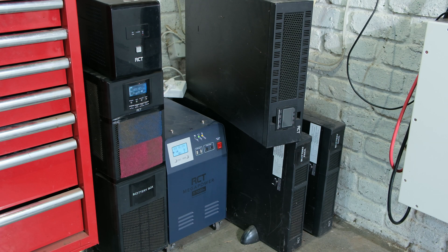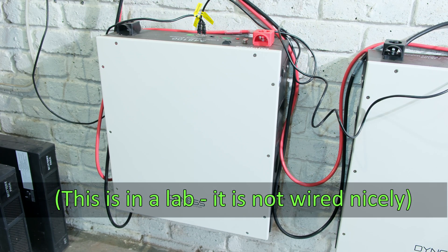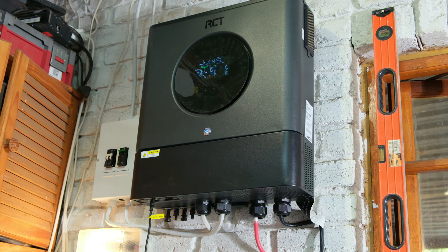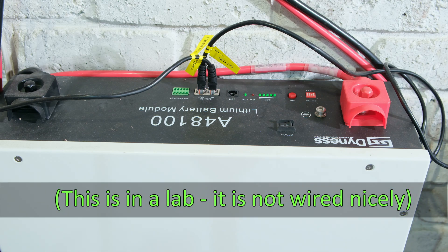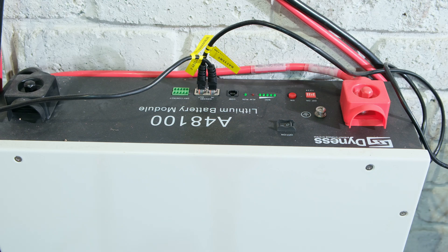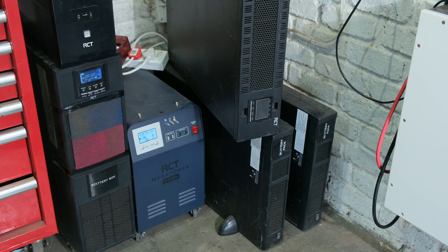Unfortunately these type of backup power supplies are not great for load shedding because of the nature of lead acid batteries. Here's an example of a lead acid battery bank - all of those batteries need to be replaced now, close to 4,000 Rand, and it hasn't even lasted eight months. A better solution is to buy a dedicated lithium battery working together with an inverter. This gives backup power during load shedding with a battery designed for at least 5,000 discharges. Comparing 250-300 discharges to 5,000, lithium is clearly worth it. The technology of lithium is far superior for deep discharges. If you go the lead acid route, you'll be changing batteries in a short time, especially when load shedding hits before they're fully charged.